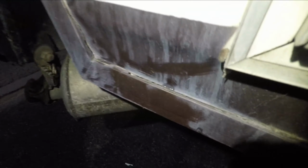Okay, as I continued, I think I noticed why there is water damage. This piece, this is really hard to do with one hand. This piece right here, oh my god, sorry guys. This piece right here is cracked, and there's nothing to hold it back. So when water drips down, it follows the seam. Water will always follow the seam. There will always be water tension, surface tension.